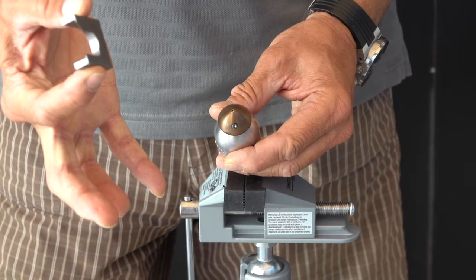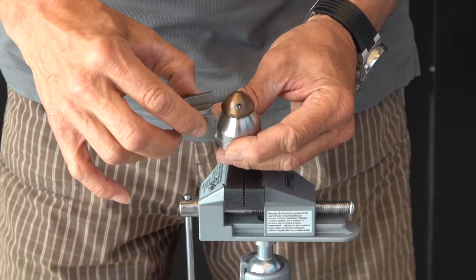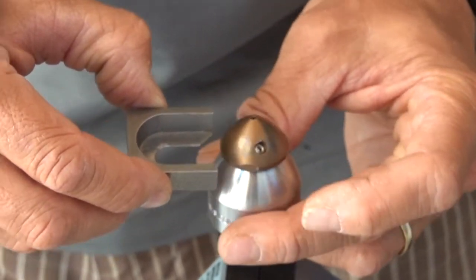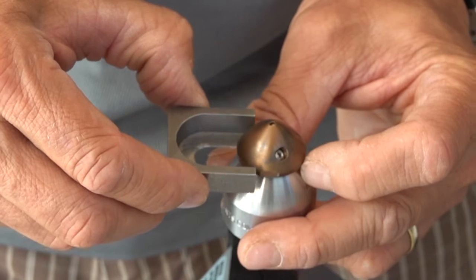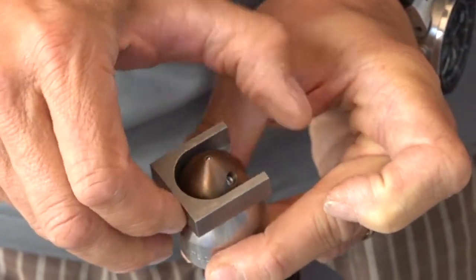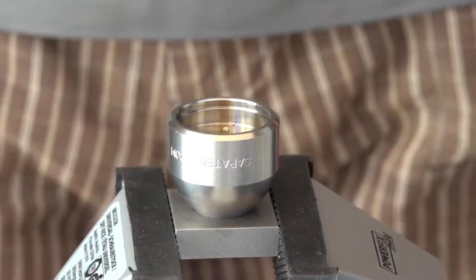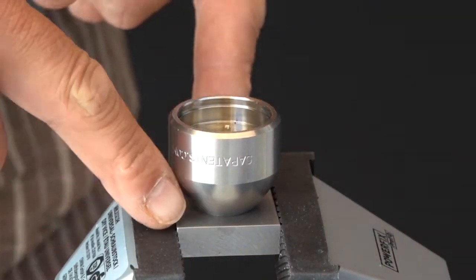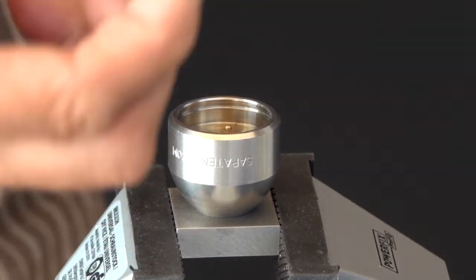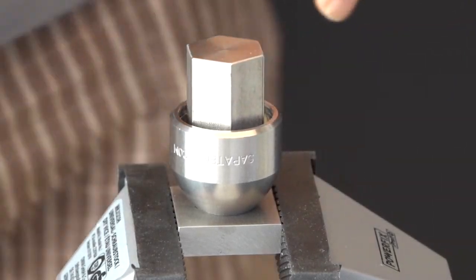And now, with the removal tool included in the WV612 toolkit, you should hold the head. Now, with the removal tool, align the set screw with this side of the tool, like that. Tighten the head in the bench vise, but not too hard. Then put the wrench spanner tool and align the post with the holes in the shaft.